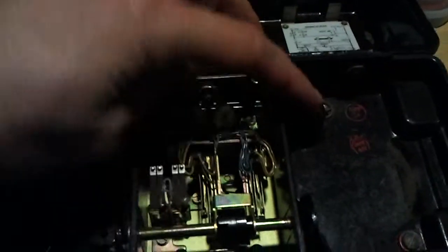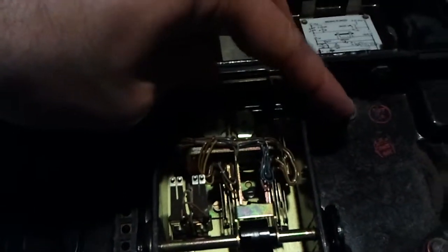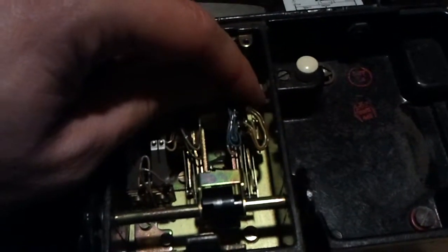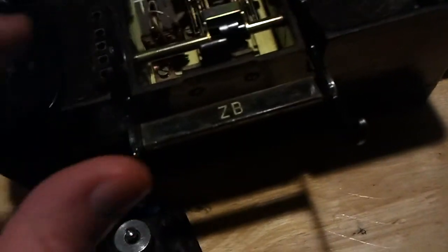This, of course, is a ringer test switch, and when you press on it, this thing's propped up for view. It operates this micro switch, so just be sure in its up mode it's contacting and in the down mode it's not contacting the plates. If you have any problems, take a fine piece of sandpaper, slip it between the contacts, and run it up and down a few times each side. Polish the contacts up. Usually solves the issue.